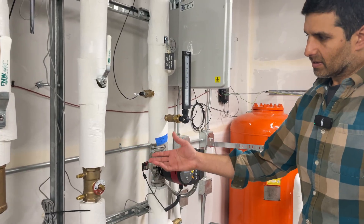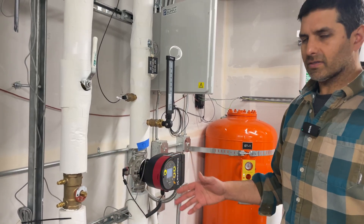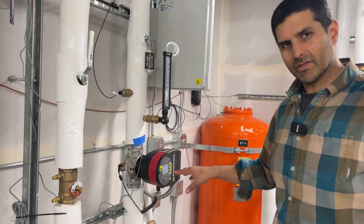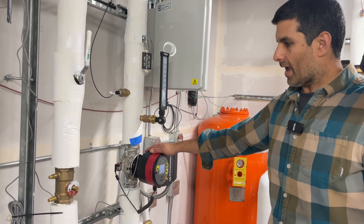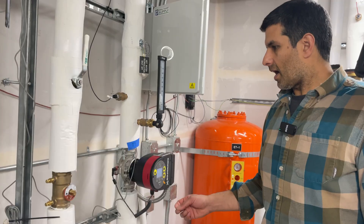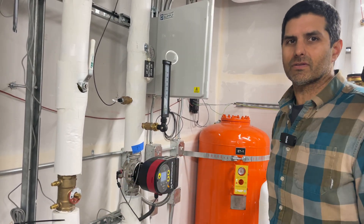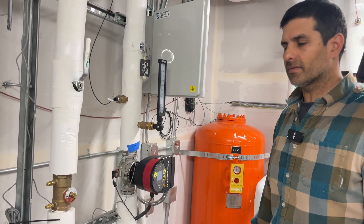In the same room here we have another valve — it's actually the exact same valve that we just measured and set — but in this case it's fully open and not being used to set the flow. In a situation where you have a constant speed pump without a readout, you could use the manometer to measure the flow across that valve to determine how much flow is actually being pushed by the pump when you don't have a readout. That's a really handy feature of these calibrated circuit setters or balancing valves — they're a flow measurement device and a way to adjust the flow.